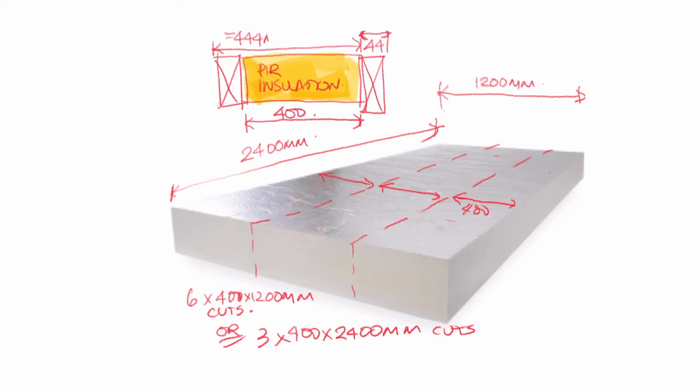Before we put the joists in place, we need to fix our joist hangers. Start with nailing the 2 holes in the underside of the joists, making sure to be a few millimetres south of the cut edge of the joist. Then do the sides of each hanger, same for the other end. Then line the joists up with your pencil lines, and because you oversized, you can gently tap the joist into the exact position. Make sure to get it level in both directions. If it's not vertical, you'll have a horrible headache with any rigid insulation when you try and get it in.